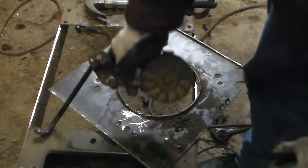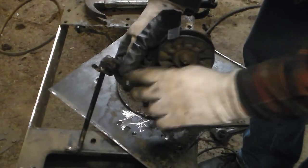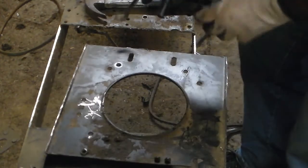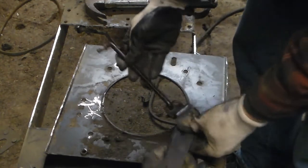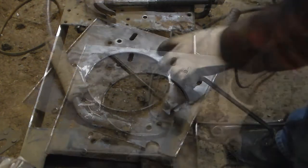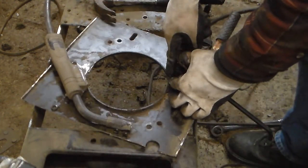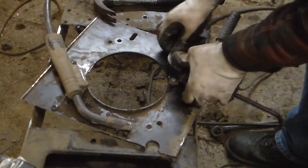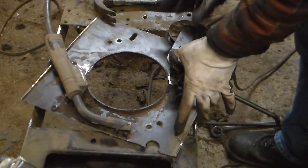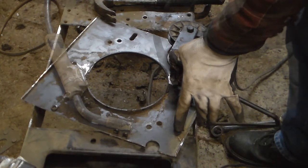We were able to pull that off — it's got a nice flat base on it. I'm going to sand this down and then reapply it, probably somewhere along in here. I'll test fit it first and then weld. We came exactly 180 degrees across from the other side, cleaned it off, and we're going to get it tacked on — making sure it's nice and plumb — then tack it the rest of the way.